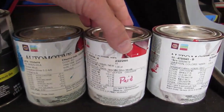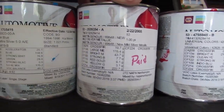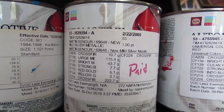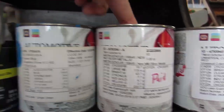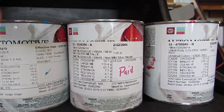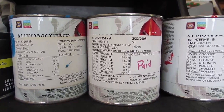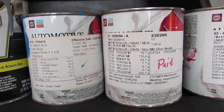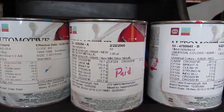For my base coat I used this silver — a mild silver metallic — which I believe is a Hyundai color. If you guys need the paint codes, feel free to pause and get them. A pint can would work for one cabinet; I used a quart can for all four and picked up a little extra just in case. When painting with a metallic color it might do what's called tiger striping, so you want to try to avoid that. Also, normally on a car you might do two or three coats, but on wood cabinets you need about five to six coats to minimize the wood grain that pops through — you want some, but not a lot, to get that similar factory feel.